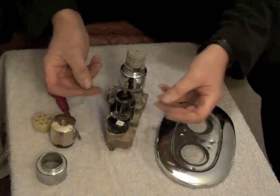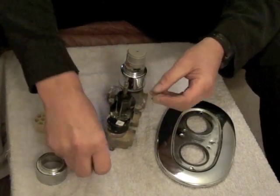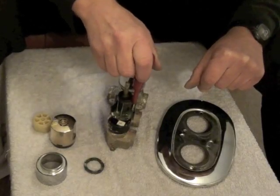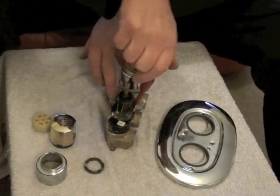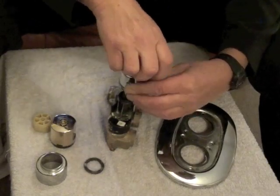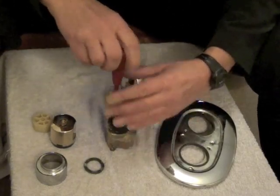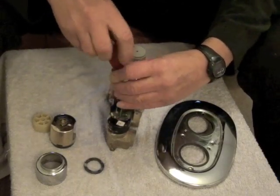And then you're left with this piece. There's a small washer here that stops the drips going through — that just comes off — and that leaves you able to get a flat-bladed screwdriver in these screws here. Just be careful that you don't drop them behind the tiles. Pack something around this area first so that if you do drop the screws you don't lose them. These unscrew like that, and that one there comes out as well.